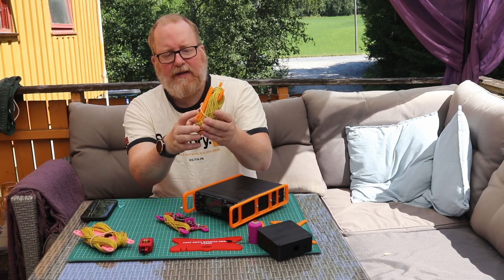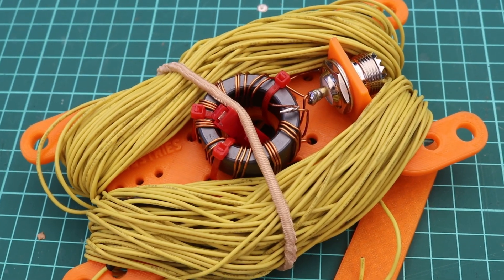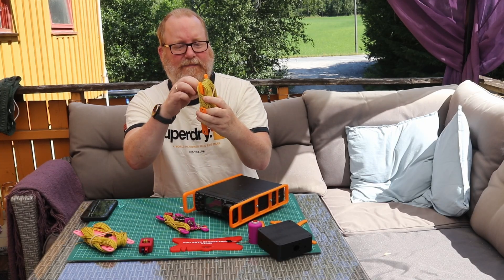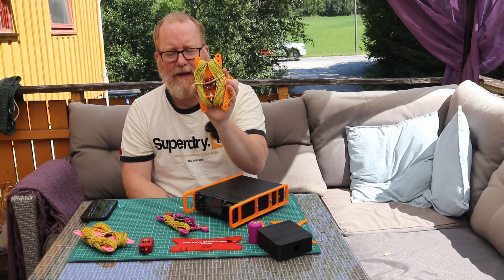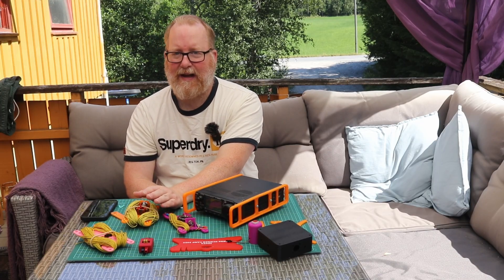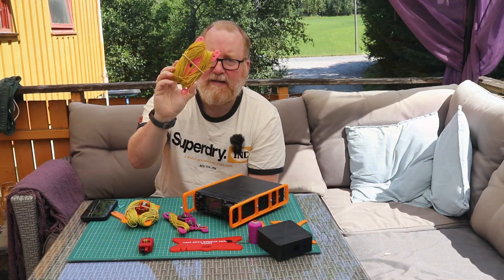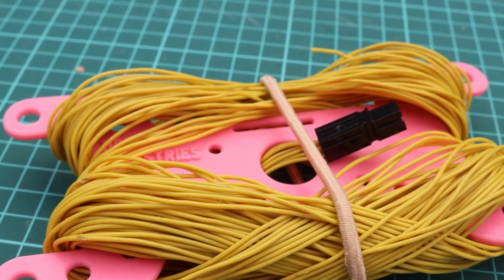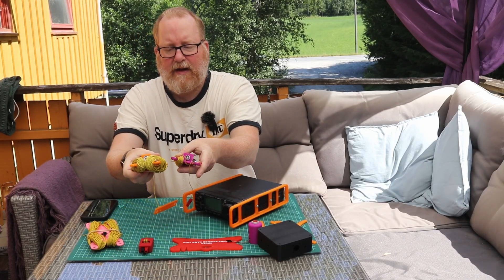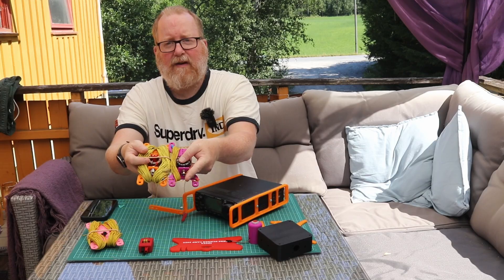Here's another one of his winders. This is a 9-to-1 with 43 meters of wire — a random wire antenna covering 160 through 10 meters. I built this one this week for the 5P0TA expedition to Bornholm, because we need a 160-meter antenna in case we figure out that 160 on Parks on the Air is a good idea. And this is the counterpoise net — the same kind of winder from Ham Radio Dude. One has an SO239 connector, one has a BNC connector. Both are available for download. Easy prints, fast prints — my favorite winder.